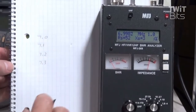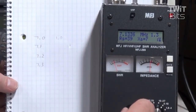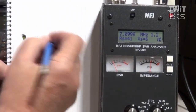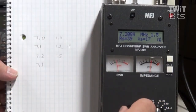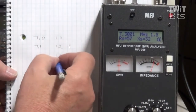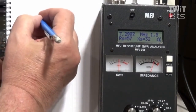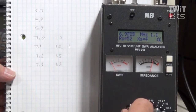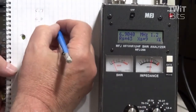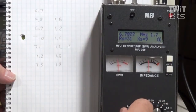At 7.0 it's 1.0 to 1. I tune up to 7.1 — that's 1.2. Up to 7.2 — it's 1.5, so you can see the SWR is rising. I go up to 7.3 — it's 1.8. Now what's really nice with these analyzers is you can go outside of the amateur band. So going down to 6.9 — that's 1.2. On 6.8 — 1.6. On 6.7 — 2.1.